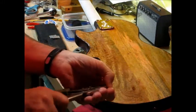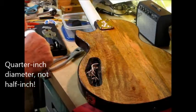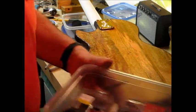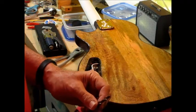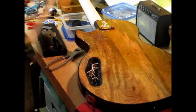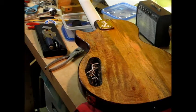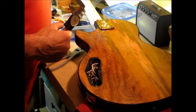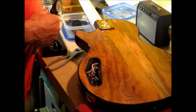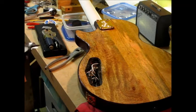That part of it's done. So it looks like a half inch might actually work. That looks like a quarter inch brad point drill. That's 250. Check the dowel first. This dowel is 5/16. I have to find the right one first. I think I see it. It looks to be this one. That measures about 250.